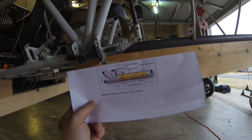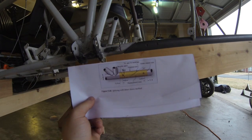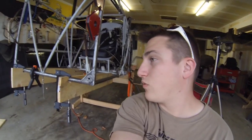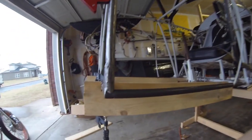Nearly finished product. We've got the 30-degree cut, we got an eighth-inch gap for welds, the sleeve's in there. New longerons — they're in, they're square, they're true. All that's left is to weld them up, but we're not going to do that yet. We'll weld it all up at the end, so more to come.